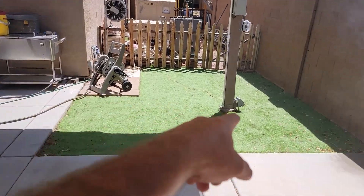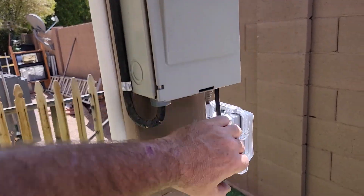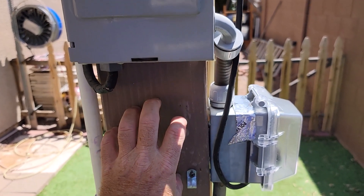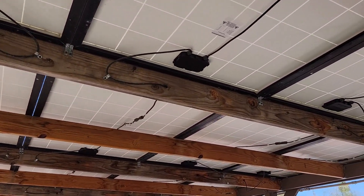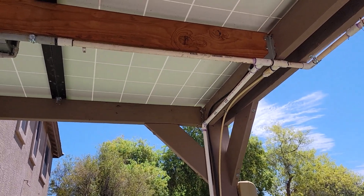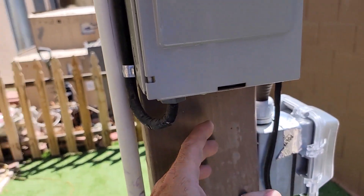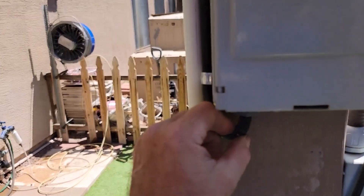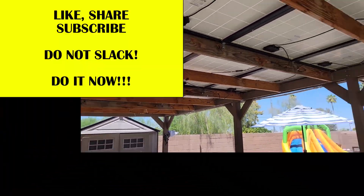The interesting thing is right now I just have it running on an extension cord from my 120 volt outlet down there, but one of these days I've been meaning to put an outlet here coming right off of the DC — this is DC high voltage right off the solar. I'd like to put some sort of waterproof receptacle for tying right into the high voltage DC. This is a 330 volt system — 30 volt nominal voltage times 11 in series making it 330, so it's an 11s2p system. When the inverter is really taxing it, it runs around 300 volts. You could take that 300 volts DC and plug it right into an ECM or a VFD and run things right off the solar, which I proved a couple years ago. I was running my whole three-ton Lennox three-phase AC right off of this, just to see if it would do it — and it would.